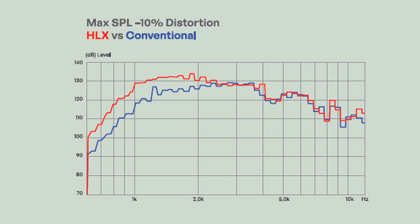Is the compromise the low end then? No — we designed it to go low. This has a recommended crossover of one kilohertz, and the AES power rating is with a second-order high pass at 1kHz on a horn. If you don't need max output you could go a little lower. The bigger version — the DH450 — you could take down to 800Hz pretty safely. Until you run out of excursion, you can go lower — there's just not much excursion available.